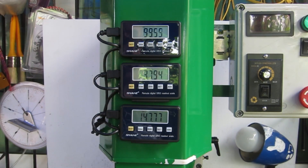Between bad weather, stuff-ups on my part, and wanting to fix this table and get all the high and low spots out of it, it's been three days since that last recording — plus I had a guy here for a full day fitting a new air conditioner. This is the x-axis now and it has absolutely no play in it. I spent a full day reworking the dovetail on that one, which was a little bit bent, and it's actually really good now. Anyway, this video was about fitting these DRO scales up — that's the x under power feed there. Hope you enjoyed it, give it a thumbs up, and I'll see you in the next one.